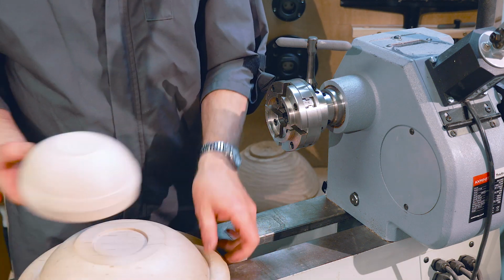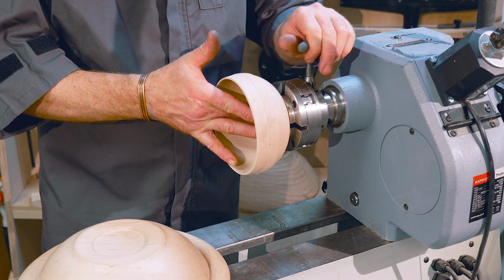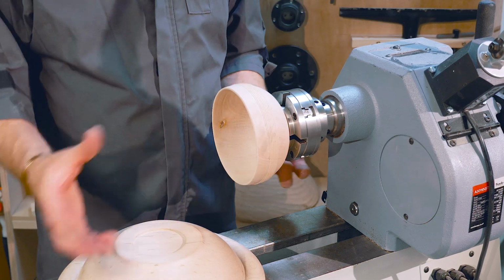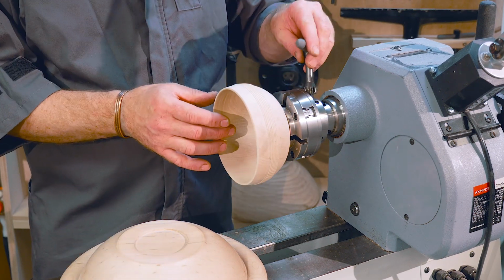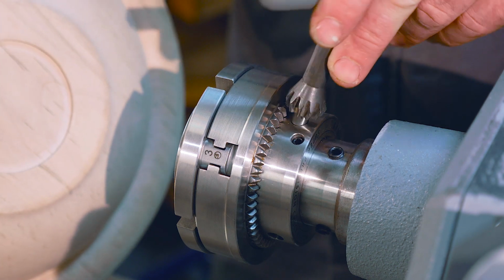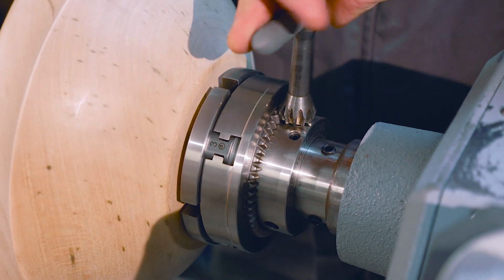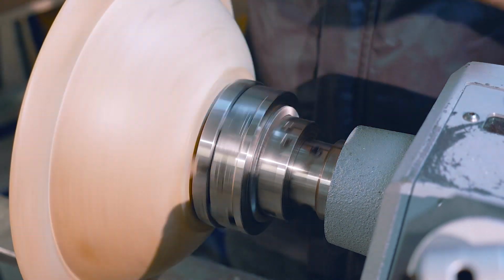On the smaller bowl, we've got straight spigot. We can grip that. Pinch that in. So even with something like that set of C jaws, you've got the diversity of allowing it to grip different sizes quite easily. That dovetail, really important, we're going to look at and show you how important that is to cut that size. So we can put this in, gently up, expand it out. So we're winding out into that base, that'll grip that nicely, allow us to turn our bowl.